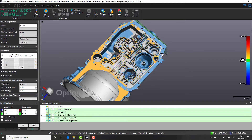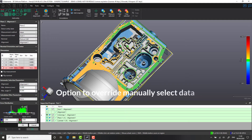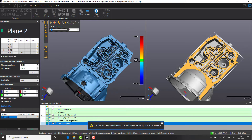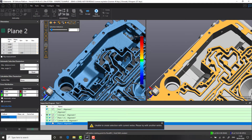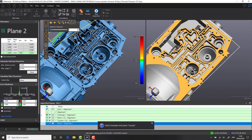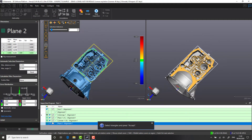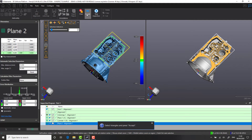In this case, we want to override and be a little bit more discreet in how much information we're using for our datum face. With our Select by Normal tool, we're able to select how much data we want to use to generate the geometrical feature. This is a similar process to that of a CMM — you can either use 10 points or use 100 points to generate your plane. In this case, we're allowing the software to select based on a similar flatness value.